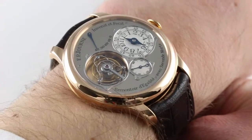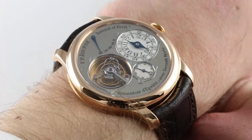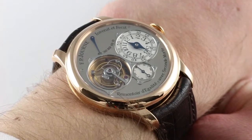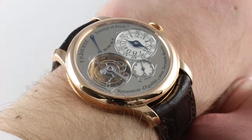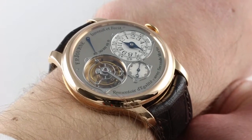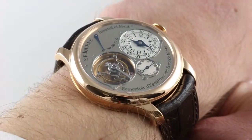After 2003, the design of the Tourbillon changed from the original Tourbillon remontoire — featuring the open aperture for the remontoire at 6 o'clock and the vertical power reserve at 12 o'clock — to the layout you see here. After 2004, the watch gained a solid gold movement. All versions of this watch are desirable, and each one has special features worth calling out, both aesthetic and mechanical, which we'll get into in a moment.